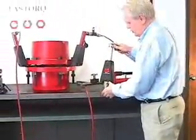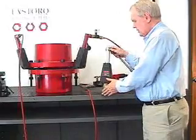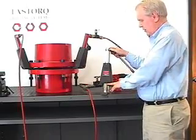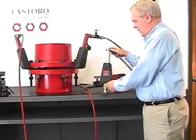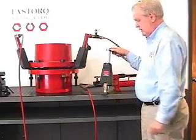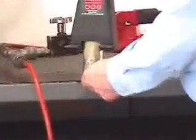The jaws, as you can see, open parallel to one another so the forces are always lifting and separating in a parallel fashion. This prevents slippage or any need for tying the flange spreader to the flange. The jaws are also serrated so that they reduce the tendency for any slippage between the flange halves.